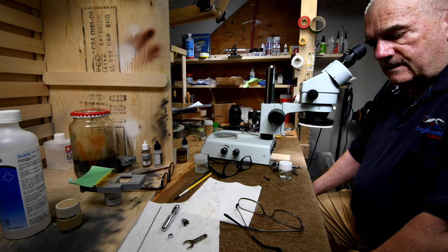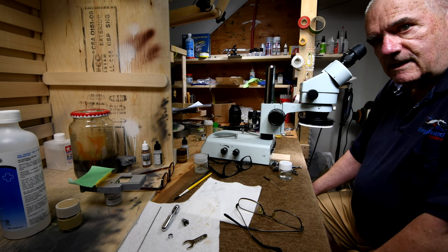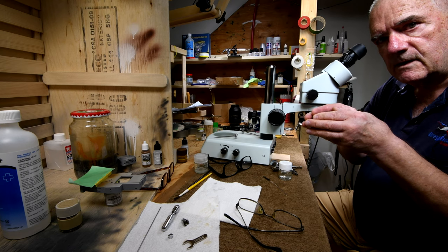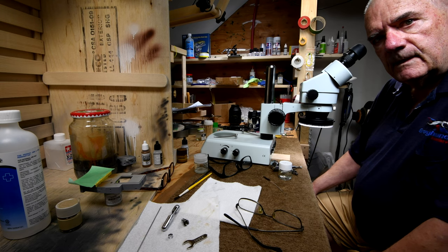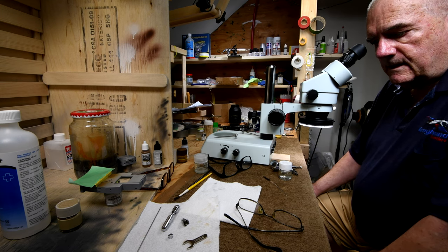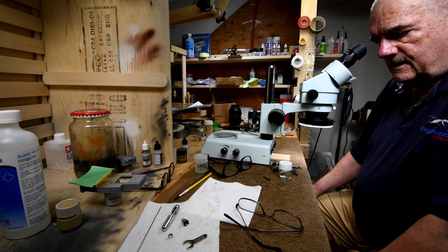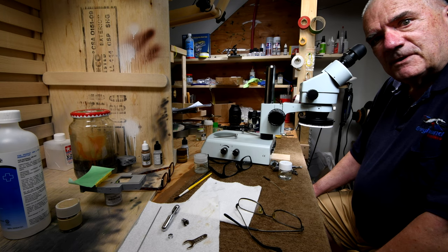I've checked the end of the nozzle to see if maybe it was cracked and the air is getting back inside. You know, where the air focuses down around the end of the nozzle and acts like a venturi, and it mixes the air, atomizes the paint. I basically know how this thing works, so why can't I figure it out? It wouldn't even spray just pure isopropyl.